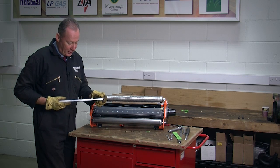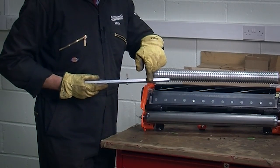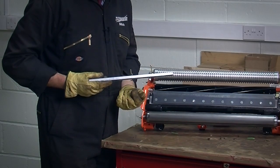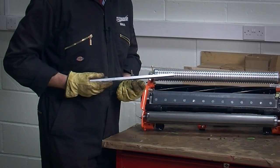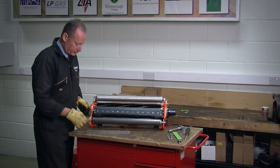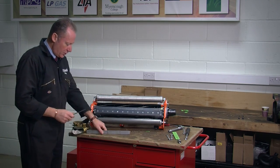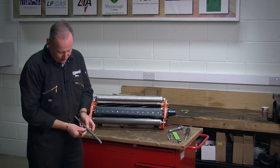The height of cut bar has got two screws to it. The front screw, which faces down, is to measure the depth of a turf groomer. And the second screw, where the head is underneath the bolt, is designed to allow me to accurately set my mowing height. I'm going to use a 6-inch rule to adjust my height of cut bar.